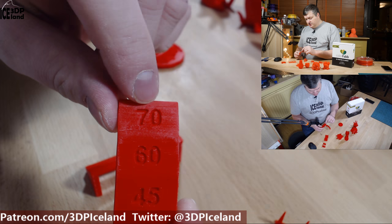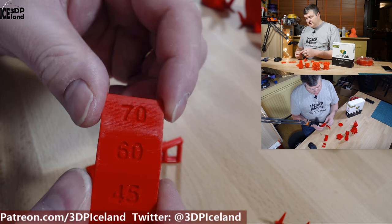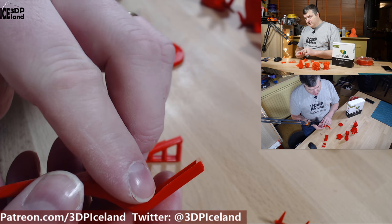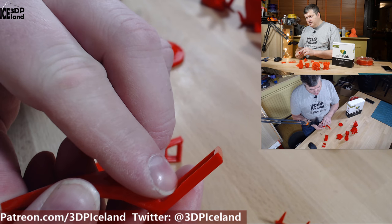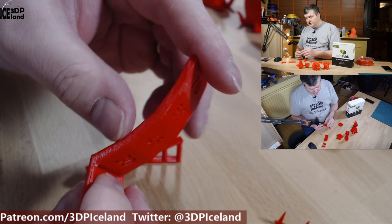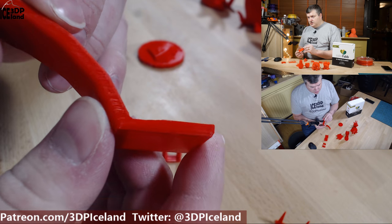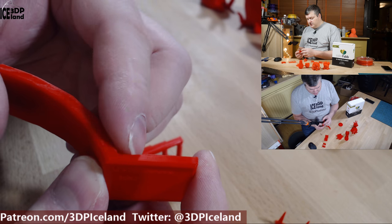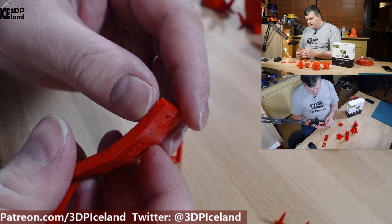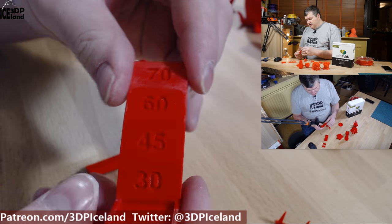In this print I was trying to sand the model a little bit just to see how easy or difficult it is to sand. It was quite easy to sand this filament. I was also using a knife to cut into the plastic to see how hard or soft it is, and this is not as hard as normal PLA — it's easier to sand and easy to cut into. So you can use this for model making where you need to fit parts together and adjust for print errors, and you can get a good finish without having to sand your hands off.